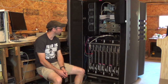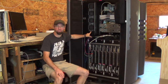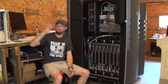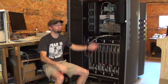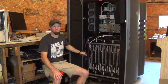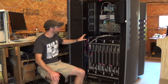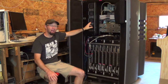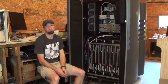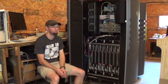Where to begin? Well, I know enough to know that the control board works — I can power the system on. I replaced one of the 48-volt supplies; it was not coming in spec and so the system had rejected it. Thankfully I have about 30 spare power supplies, so I just marked it and replaced it, and the replacement is good. I've got orange lights everywhere. The control board I know is good — it's throwing green lights. And the rest of it, well, we'll have to see. I'm not going to use a sequencer, so I don't have to worry about that. I know the D240 powers on. I don't actually know if the DVD-ROM drive works or if the internal disks work — the disks should be fine, but I have horrific luck with DVD and CD-ROM drives, so hopefully it works.